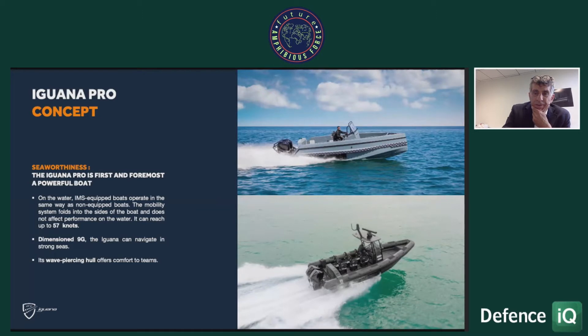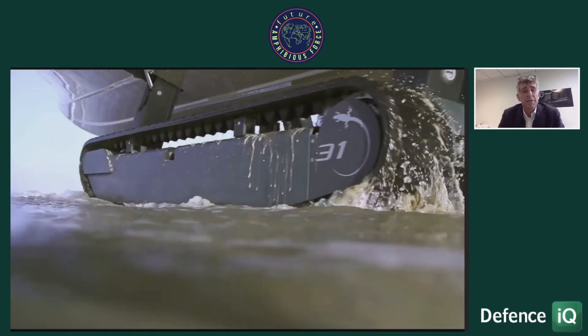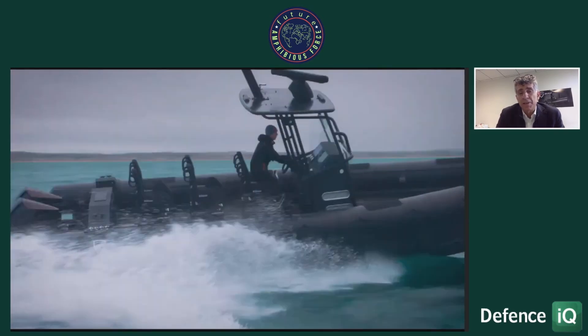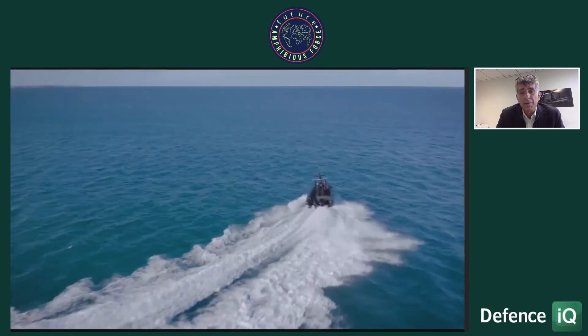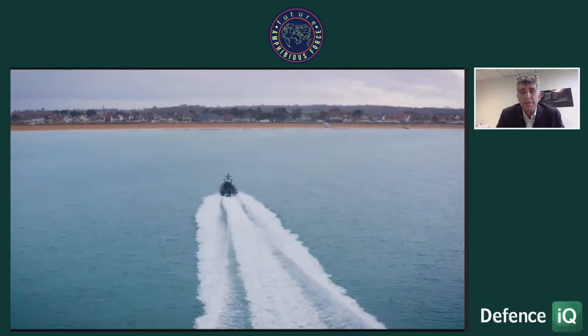The main idea is to have a very good boat — strong and very powerful, which can go very fast. The center of gravity is very low, so the boat turns flat and doesn't heel to the side. It goes across waves in strong seas and is extremely robust and fast. The value of the system is that you can launch the boat in significantly large waves and land in waves too, because the deck and the boat itself sits on top of the arm system, so waves pass underneath the boat when it lands and when it's launched.